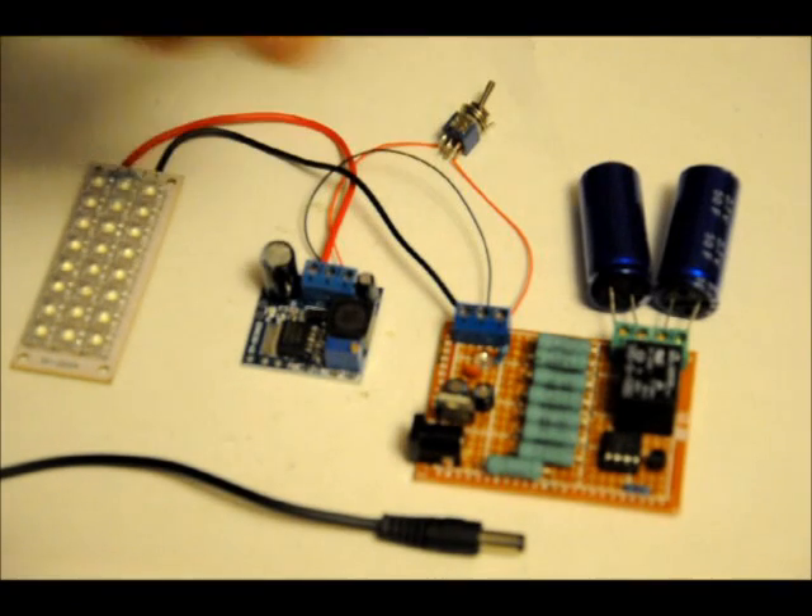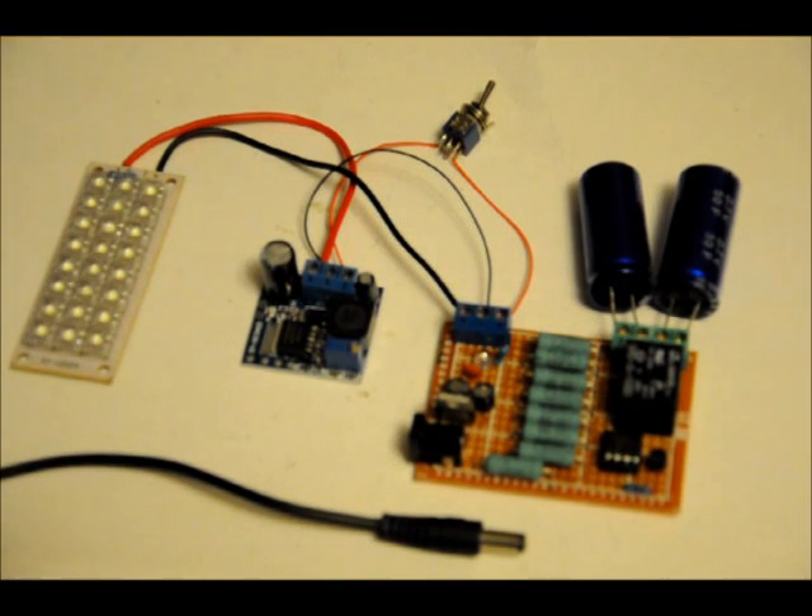You can interchange these capacitors. At 8 volts in this configuration, once you plug it in and it charges, it takes about 5 minutes to charge from 0 volts, and the light will output for about 15 minutes. If I were using two 400-farad capacitors in series, it would go for well over an hour. And obviously the charge times would differ.